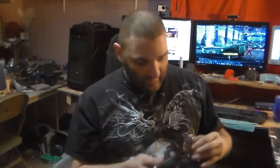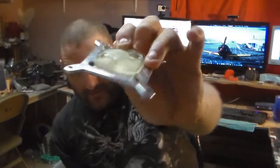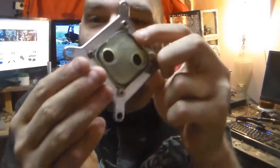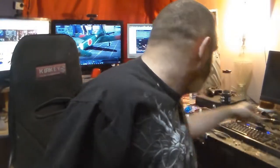As you can see, this is a very well-used water block. That's not the stock top — it's not a plexi top either. That is a two-part epoxy top that I sand-cast molded from the original. You can still see the original ridges from where the original Swiftech top was pushed into the sand. It's an old method used by mechanics for car parts you couldn't get anymore — like Morgan and various other vintage cars. I learned that from my dad, and when I showed my friend Bucky, he said, 'So you do bring something new to the table.'